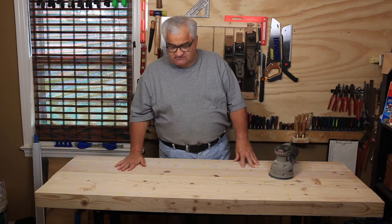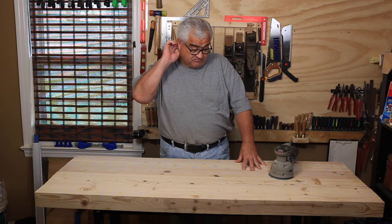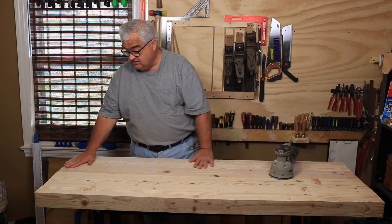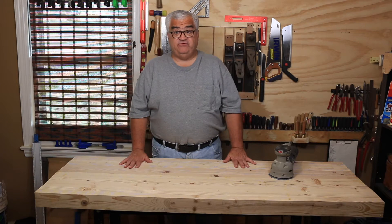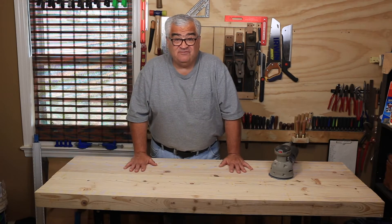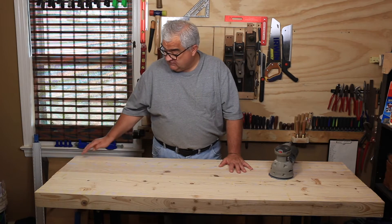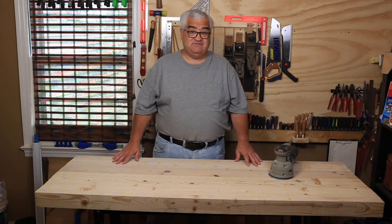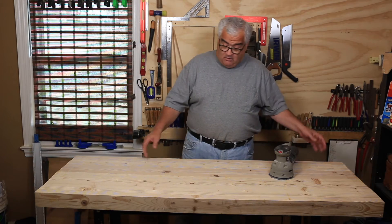Welcome back — we are now back upstairs in the shop and the table top is glued up and in place. It's not fastened to the Kreg Universal Table yet, just sitting here. I've sanded the bottom smooth — there's no seam, this is going to sit nice and flat. I did a lot of scraping of the glue squeeze-out on the bottom. I'm going to stop this video here because it's getting long. The next video we're going to cut the ends off straight — there's no way to get glue-ups to line up perfectly, so I'll cut an inch off each end to bring it to exactly 60 inches.